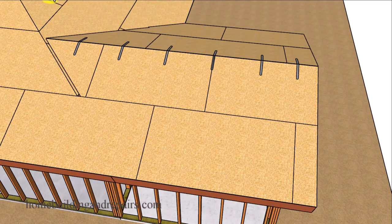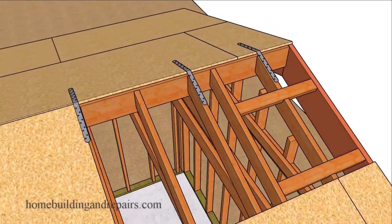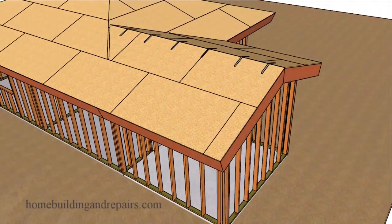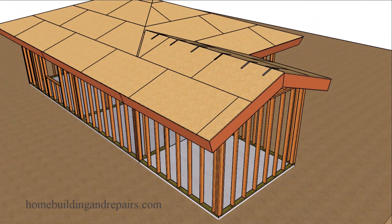Most of the time the spacing is going to be 48 inches on center — that is a maximum spacing, you could always make it smaller but not larger. Sometimes by simply adding one more strap, you can reduce the length of spacing to create something a little stronger. So there it is, the gable roof home addition instead of a hip roof home addition for this particular design.